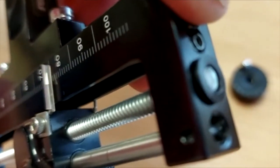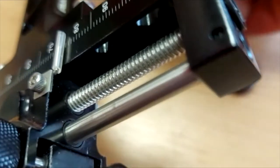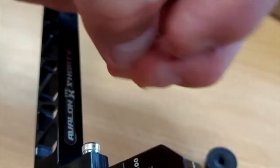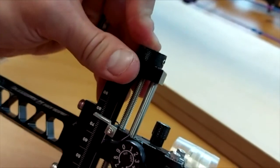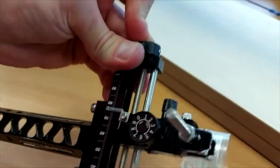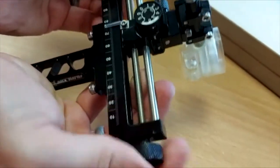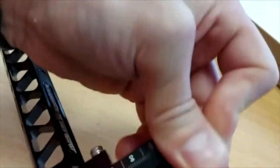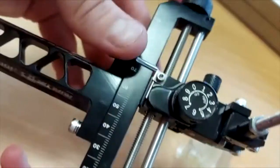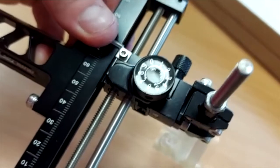Make sure this stays dry. So give it a good clean out with anything that's dry, and then we just put it back together. So once that's clean, put a ball bearing on the top and then push the wheel on top of it. And then from the bottom again, we're going to do this screw thread up. And look, the gap's closing because it's screwed into the wheel at the top. And there we are. Magic. A really nice, clean, freshly clicking sight.